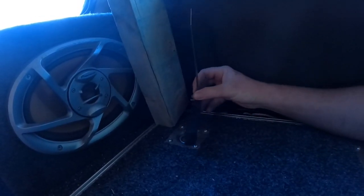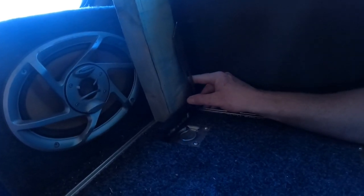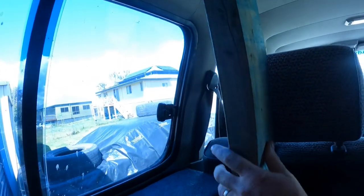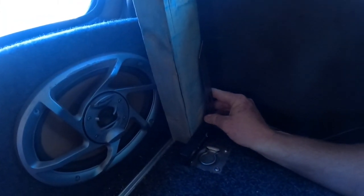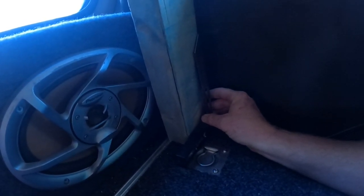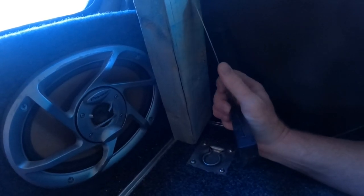And I've got a sliding bevel. Just sit that flush on there on the end and then set this timber so it's following the angle of the chair, the back of the seat, so you can sort of, yeah, you get the idea anyway. And then just set the sliding bevel to the same angle, then you'll be able to hopefully replicate that onto the steel. Well, hopefully.